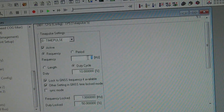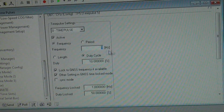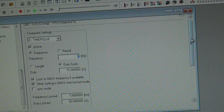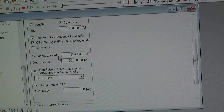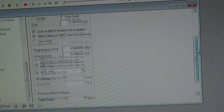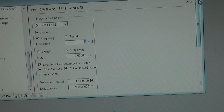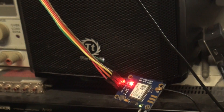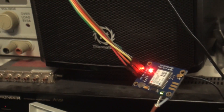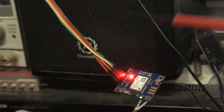Going down here, once it's frequency locked I've got it set to 13 MHz. Duty cycle and so on — you upload that to the GPS and it will permanently stay in the GPS. So the GPS will always do what it's been instructed to do from that point onwards. The actual GPS board will output any frequency you want from 1 Hz to 15 MHz.